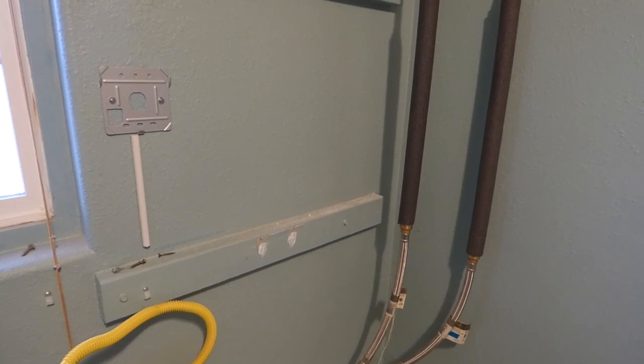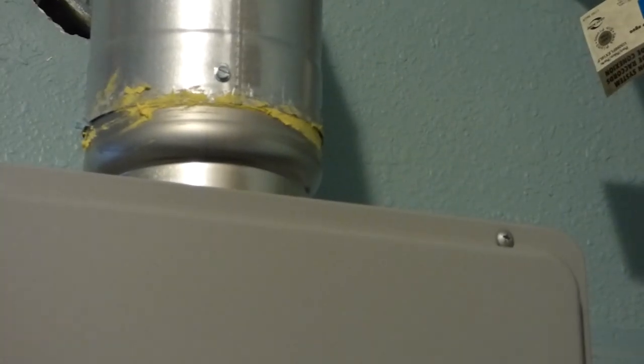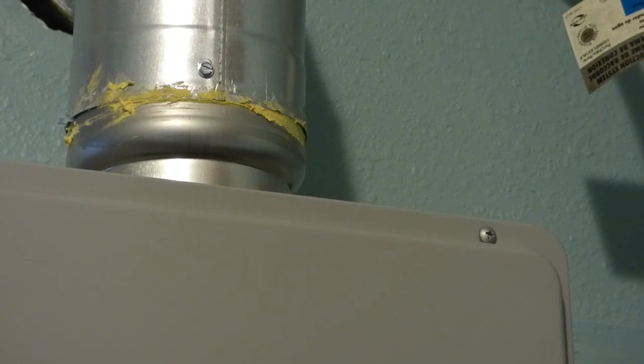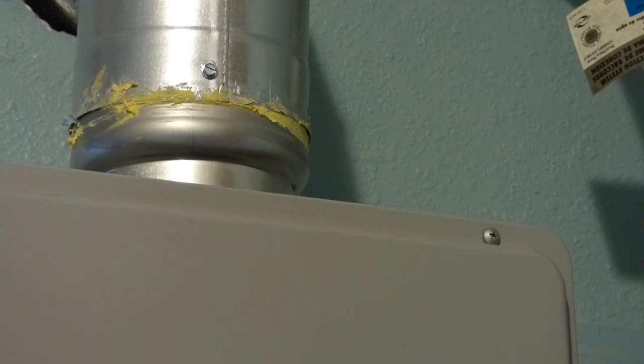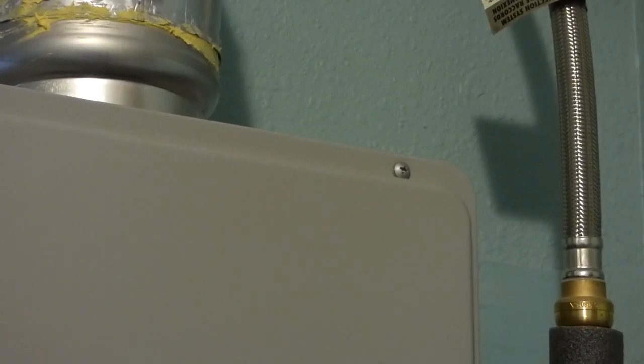So that's in there. I even sunk a screw in to keep the duct from flopping around — it was pretty snug there. That there is all sloppy — I'm going to caulk around it some more to make sure there's no gaps. The top definitely has some repair to be doing — that's probably not going to be on this video, but it's basically going to be wall compound and some backing to let the wall compound stay there, and then priming, sanding, priming, painting — all that kind of stuff. Try to keep all the dust from going into your new unit too.